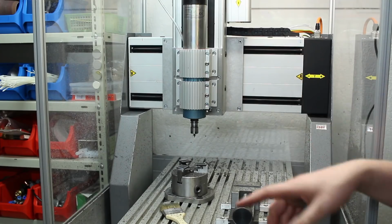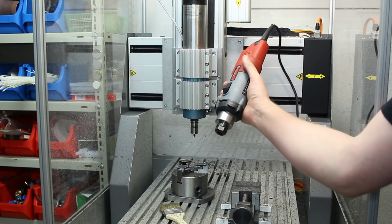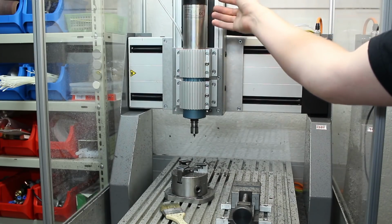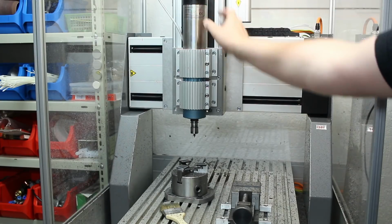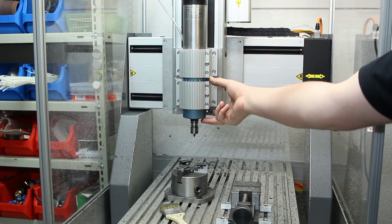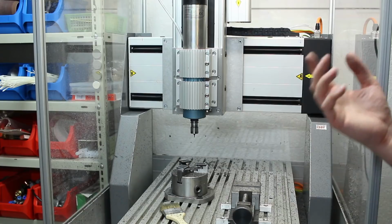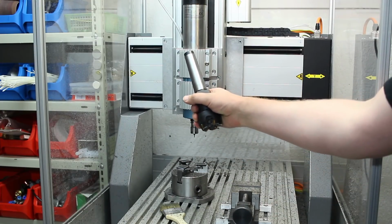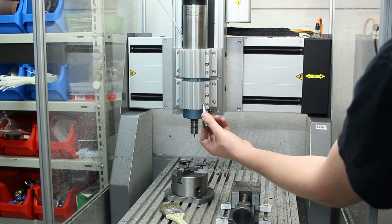And then this happened. As you can see, we're over at the CNC router, and you might remember I always had this Kress router motor mounted here as a spindle. I got rid of it and I replaced it with a 24,000 RPM high-speed spindle, high-frequency spindle, 0.8 kilowatts, or 800 watts for that matter, with an additional toolchanger attachment. Spindle goes from here to here, and the toolchanger is this blue part down here. And what this does is, it allows quick tool change, like on a normal vertical machining center with 40 taper tooling or HSK tooling. This is a number 10 taper, so it's tiny. This is a number 4 Morse taper with a shell mill, and this is a number 10 taper with a 6mm chamfer mill.